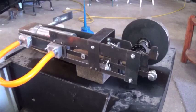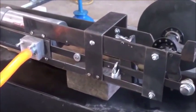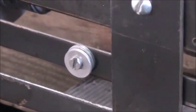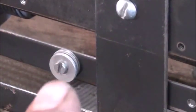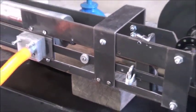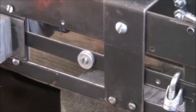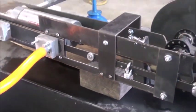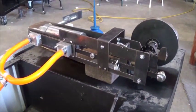So I want to show you what I've done here to stop the over-travel that I was demonstrating in the last shot, where I had to hold my finger there behind the end of the valve rod. Right here at the tip of my finger, you see that little set of washers and little screw going through there? That's our bump stop, and it was very, very simple — I just had to get the right size washers. It stops it right at the perfect spot in the valve timing to create a higher RPM out of this motor. I'm only going to run it at low air pressure right now, but we're going to hook up the air and take it for a run.